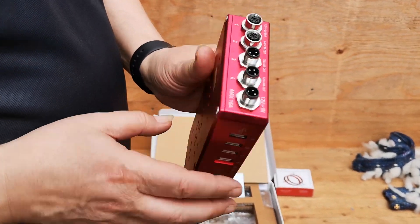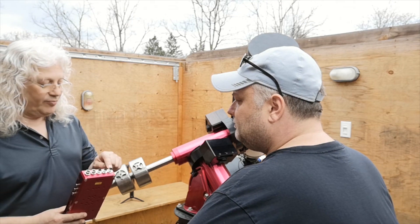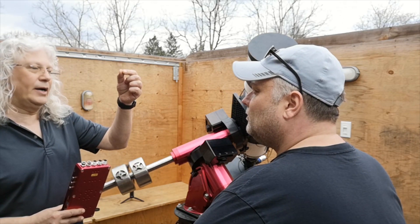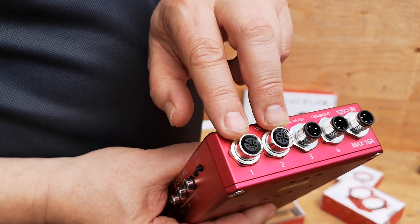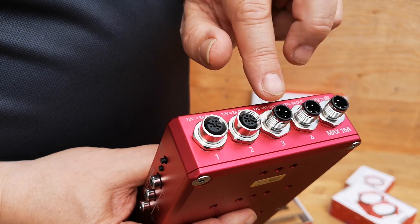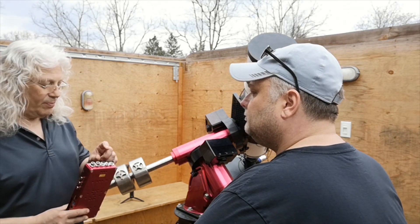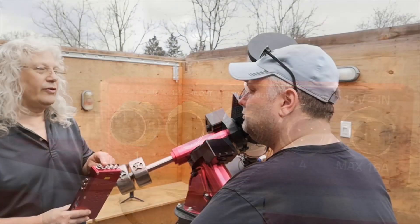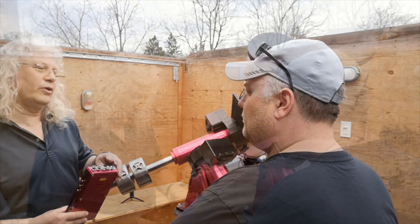Let me give you a quick walk through the bells and whistles. Here's the business end for power — power in and power out cords. Prima Luce did give me a 12-amp, 12.8-volt power supply with an extension that will run up through the center of the power mount and connect to this. It allows you to power up to four devices. These two ports over here are 3-amp maximum; these two are 8-amp maximum. Now, obviously that totals much more than 12 amps, but I'm really only going to need two of these. The mount will have a separate power supply because it's 48 volts. My QHY camera will go into one of the high-amp ports, and my Optech focuser will go into the other.